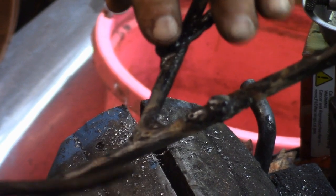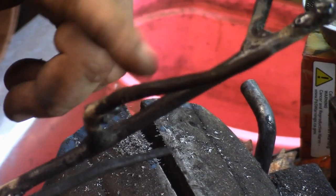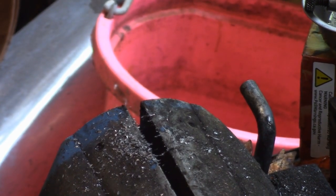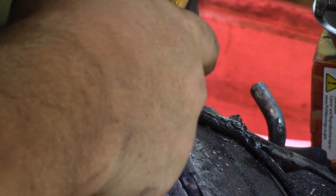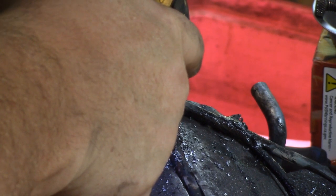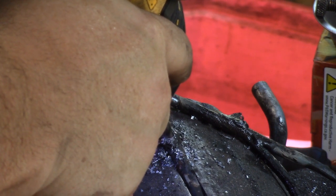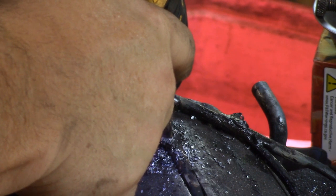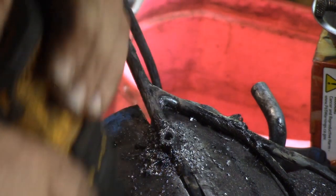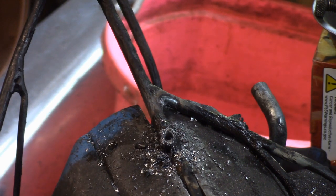The thing about this is if you're going to solder them, drill them and solder them relatively soon. That way there's no oxide that builds up on the inside of that steel. As long as no oxides build up, when you heat it up and you see the inside color change — like when you're coloring a piece of steel in the fire — it'll go through those oxide changes. When it gets to about a blue and just past blue, you know it's warm enough to melt the solder. Just wait for the color change, stick the solder in, push it, and watch it wick right up the walls.